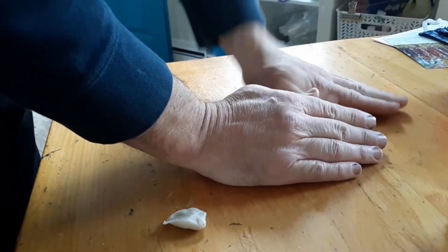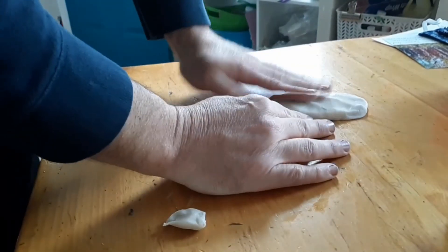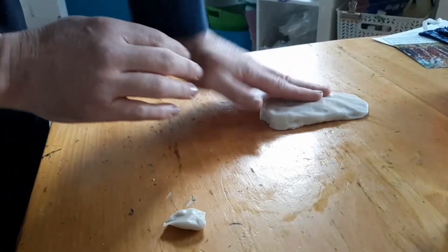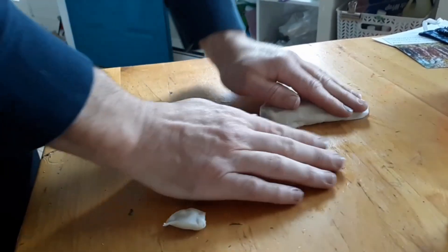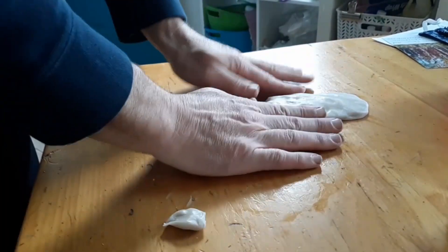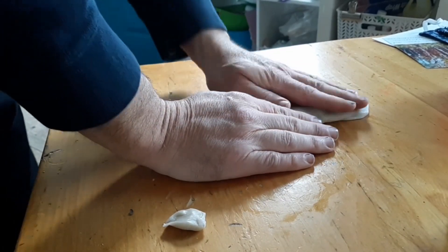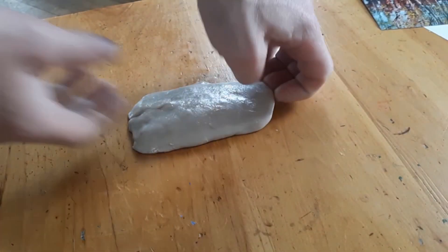Make one part of the mold by pressing the putty over the shape that you want to duplicate. The putty starts as a flexible solid that is heated in the microwave into the putty you use to make the mold. Smooth the part of the mold you want to press over the object and then just press. Let it cool, or place it in the freezer to cool and solidify even faster.